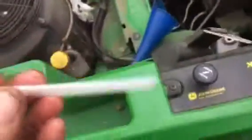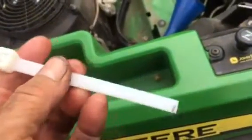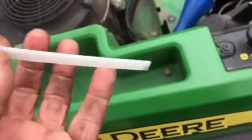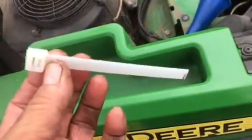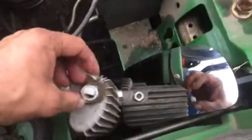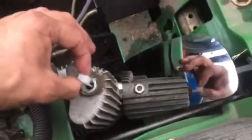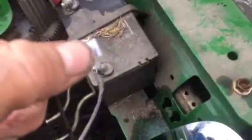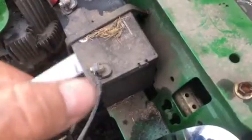If you don't have a mirror, you can make your own little dipstick. I've got a large zip tie here, and from the bottom of this little square nub to the end is four and three-eighths of an inch — that's the perfect length for a dipstick. I can put that in there, but don't use something you can drop in there because you'd have to pull the filter off. Make sure you've got something that won't go all the way in. Four and three-eighths of an inch is the perfect dipstick length — as soon as I see fluid on the end of it, I know it's full.